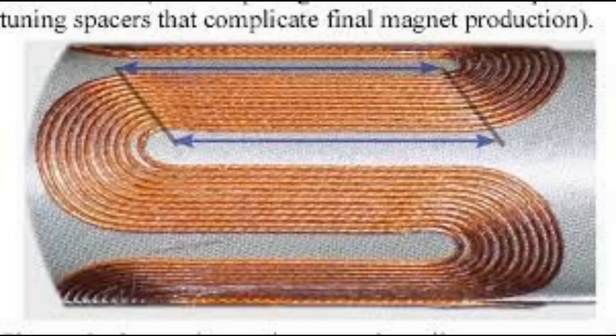What is a serpentine coil? Well, the clue's in the name — it's wound like a serpent. Normally what you do is wind a coil round and round and round; it's just a mechanical thing and it's easy to do. A serpentine coil you wind in an S shape, going in an S. It can be a real pain to wind if you wind it in situ, however there is a really simple method to wind it.